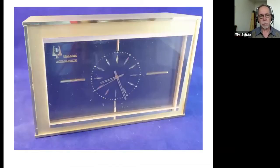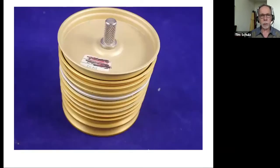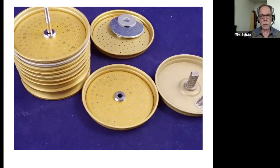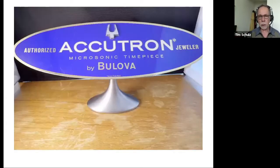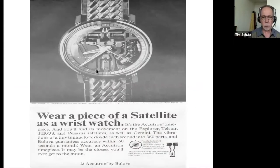This was their first quartz-driven clock — it had a large quartz crystal and a 214 movement with a very long stem going all the way to the back through two circuit boards. Chris Radick has a container that holds index wheels for the 214 — this particular one only had a couple trays of wheels left. It's interesting to see how they handled these super-delicate parts in the factory. These are some ads pulled off the Dash-2 site. I'm going to stop sharing now.